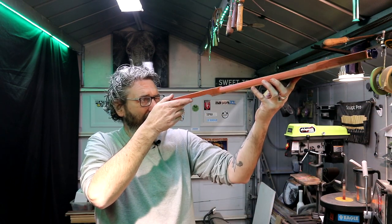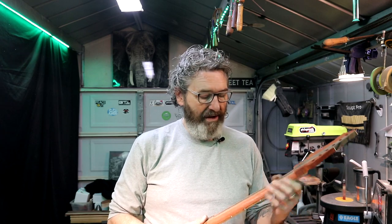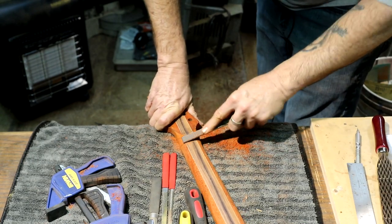I'm going to turn it around and do the same thing on the other side. As I get closer to the end and when I'm doing the actual sanding on this neck, I like to just close my eyes and run my fingers over it. There's something about closing your eyes — it heightens your sense of touch and you can really feel any little inconsistencies become really evident. So I like to pay really close attention when it comes time to sand this thing.